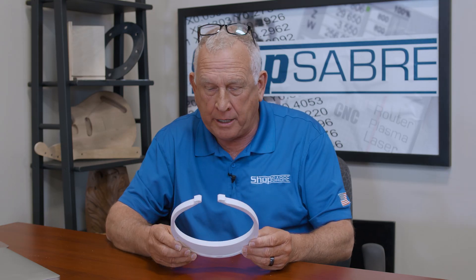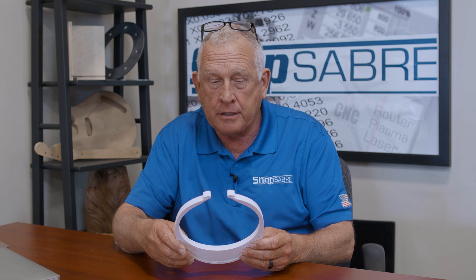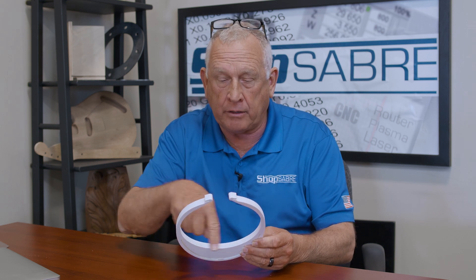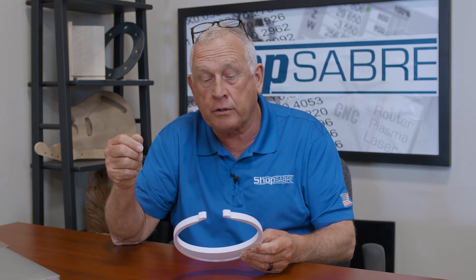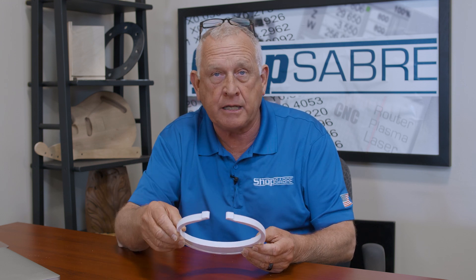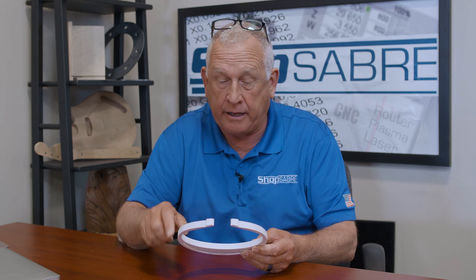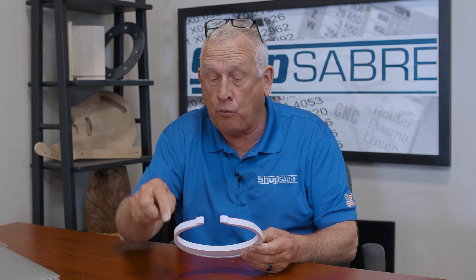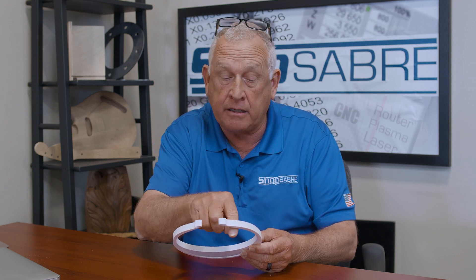This is one of our finished parts — I call it a ring. It's got these little narrow pieces that are really hard to hold with vacuum. But if we leave the material in the middle connected, that becomes a much larger part and we can hold it with flow-through vacuum. So when we tool path, the first thing we do is rough this out using a quarter inch bit with two passes, leaving an onion skin of about 30 thousandths. Then we put the eighth inch tool in and machine the little notches for the bands. Then we cut the slot for the face shield, do a finish pass on the outside cutting all the way through, and then an inside finish pass reducing the onion skin to 10 thousandths.